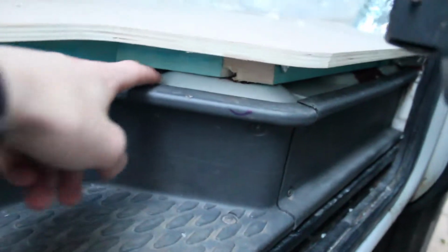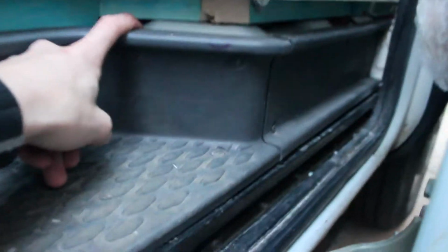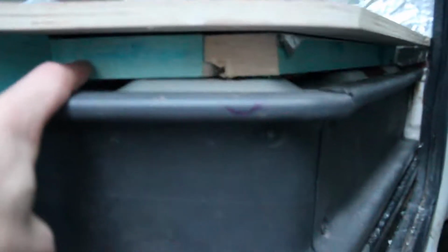Then, as you can see, there's a floor down there. Under the floor, as you can see here, we have the original flooring there. Then we have some 25mm battens, and they're laid out in squares. I might be able to show you. If you can see under there, they're laid out in squares, cut to the right size, filled in with Celotex everywhere,